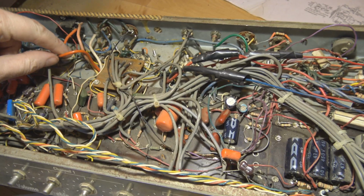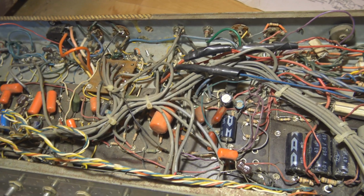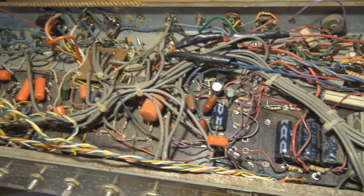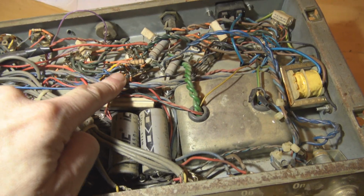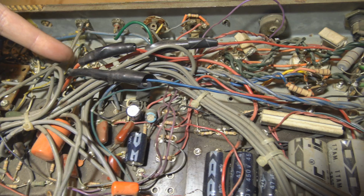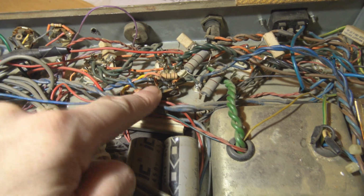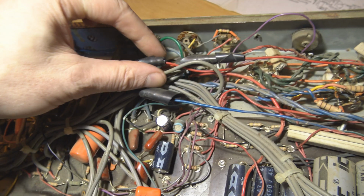Look, we got an impedance selector for the output jacks. I'm only using 16 ohms, so we can get 3 of those out of there, whichever, I'll find out which. Here's where we've got an auxiliary transformer for the filament windings on the preamp tubes, which is under the amp. The wires come out of a hole over here, somewhere, come over here to our faux center tap, and then go back. I don't understand. We can move this over here.